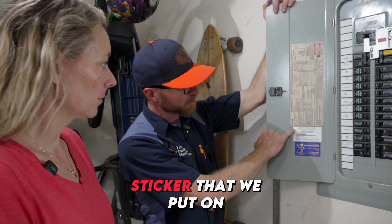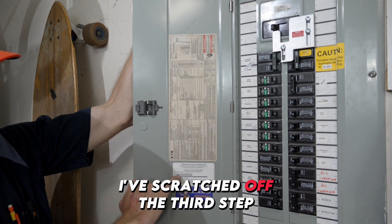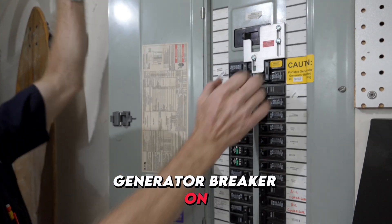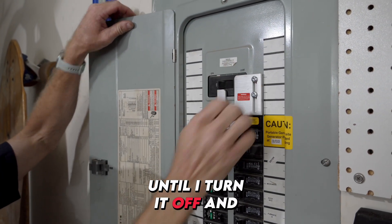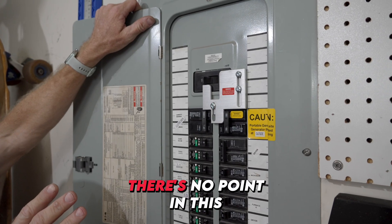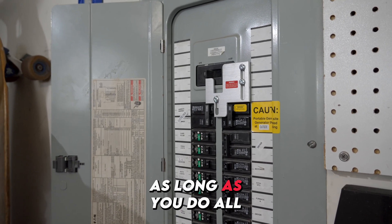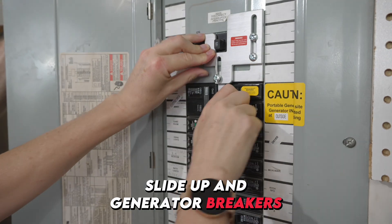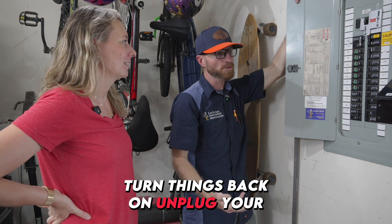Now inside, I can show you the instruction sticker we put on all the panels. We've already done the first two steps: plugged in our cords — electric and gas — and started the generator and warmed it up for a couple of minutes. I've scratched off the third step because you don't have any high loads that need to be turned off. Next, turn off the main breaker, then move the generator breaker on. This is your interlock. It prevents you from turning on the inlet plug breaker at the same time as the main — you have to turn one off before the other. That means you don't back-feed your cord and you don't back-feed the utility. There's no point in this process where you'll be exposed to a hazard. Even if you forget a step or do it backwards, it's still going to work as long as you do all the steps.